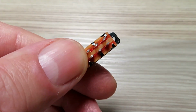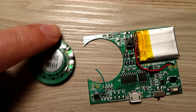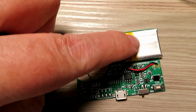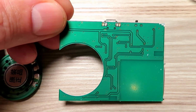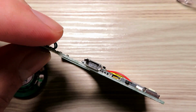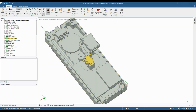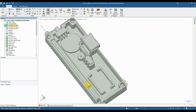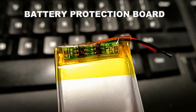So anyway, I bought some different slide switches, double pole, double throw variant, and I attempted to get this thing disassembled so we could fit it properly inside the case. There were a few things I needed to do to get this in. One was to remove the battery and put it inside the case, and the other was to move the speaker so it would actually be audible through the grill in the front of the unit. To do this, I fashioned a space inside for all of these items, recessed the speaker in, dropped the switch in and made it self-contained, and it all fitted in tight but rather nicely.